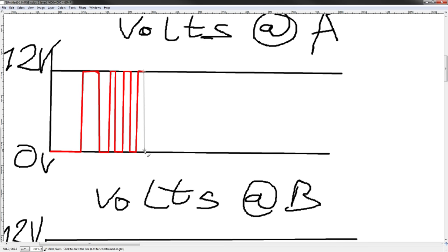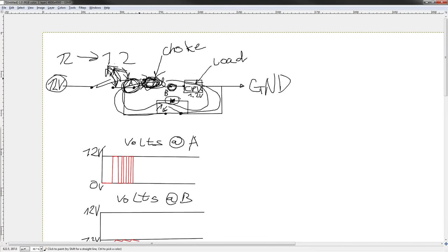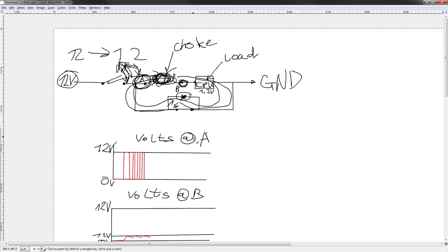Basically, the entirety of a single phase VRM — or single phase buck converter — is that you have this upper switch which charges and discharges this inductor. The charging and discharging of the inductor causes all of the voltage drop; that's what converts your 12 volts into the lower voltage. And then you have this lower part of the circuit to make sure that the inductor doesn't blow everything up, because the inductor needs to keep pushing a current. If you just cut it off, it's going to try to dump all of its magnetic field energy into electric current, which it can't because there's no closed circuit. So it's going to blow stuff up — which is why we have this part, to ensure there's a closed circuit available when the inductor starts to discharge.